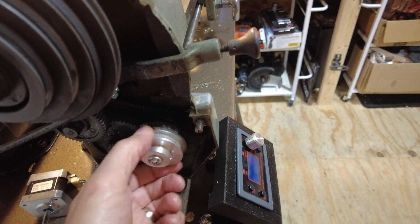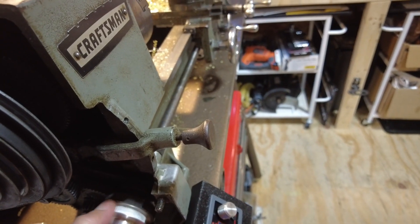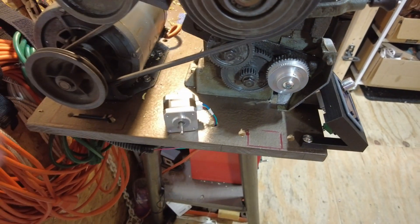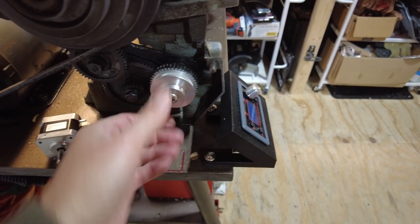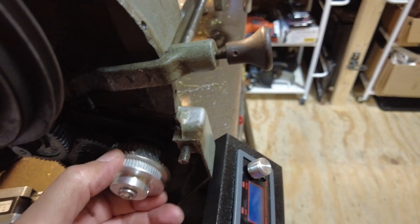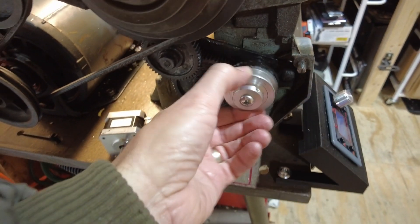There's the first epoxied up gear that we will test. You can see the lead screw turns freely, and we're attached here. The nice thing about these old Craftsman things is that they're really standard screw sizes. This was just a quarter-20 bolt that we cut down. And there's a little keyway, a little key in there, which is going to keep this on there nice and tight.